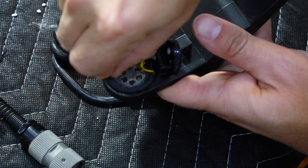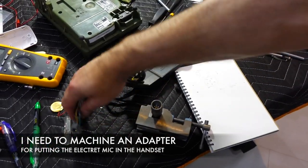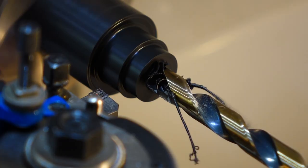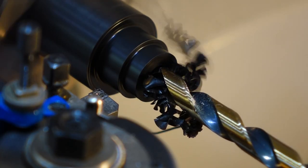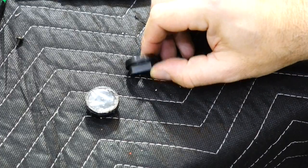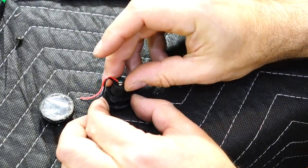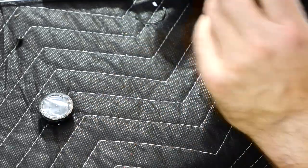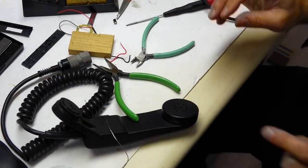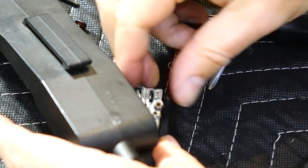There is a microphone, which I checked — it's a dynamic microphone. So I have to swap it for an electret. The electret within the adapter will look exactly like the dynamic microphone it replaces. One last detail in the handset: I need to disable the push-to-talk wiring. Just taking that little loop away was enough to do it.